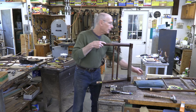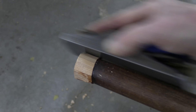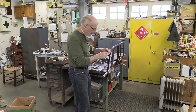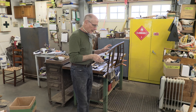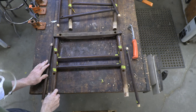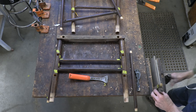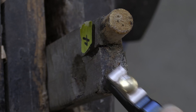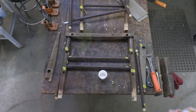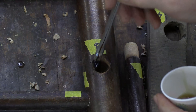This dried overnight off-camera and I did the other three, so now we can carve them down. I'm finding that just using a hand plane is fine — I don't even need a chisel, it just takes about five minutes per foot. I think I'm ready to glue these up. I need to trim these feet a little bit — each one of my blocks was maybe an eighth of an inch too long — but everything seems even, so I'm going to glue it up and then trim the feet.